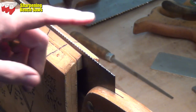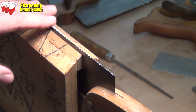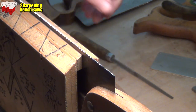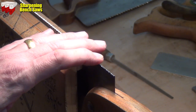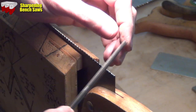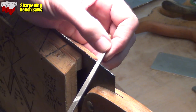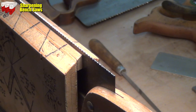If when you first notice your saw is getting a little bit blunt you immediately go to this step - just two or three light strokes for every gullet - you can refresh the saw and you can probably do that about four or five times before you need to go through the full process. So just for a general resharpen, all you need to do is this final step of probably two light strokes with a saw file set to the correct angle, just to freshen up the edges.